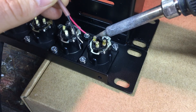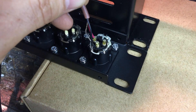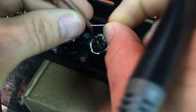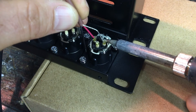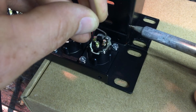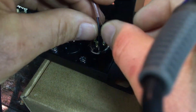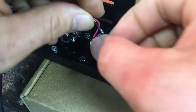Heat it back up. Let the solder in the cup melt. Touch it, push it all the way to the bottom, and then let it harden before you move on. The worst thing you can do is move it while it's in the process of hardening. Then I'm going to heat the back of the second cup, push the wire in — I've found the geometry that works for me for getting these things in. Make sure that solder cools sufficiently.